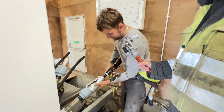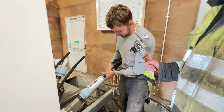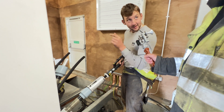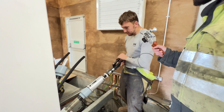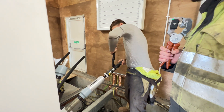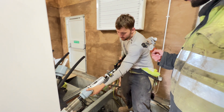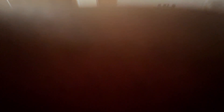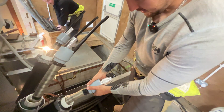Here's one you saw earlier — that clips over there. Then we screw this up to get the little plug against the tension cone. What we're doing is pulling against the thrust piece and the tension cone to make sure the contact ring is on tightly and in all the way. It's clicked now, so that is done — we can release the pressure. Once that is on there, you can pull the stress cone forward up to that piece, and voila.